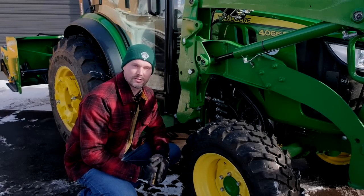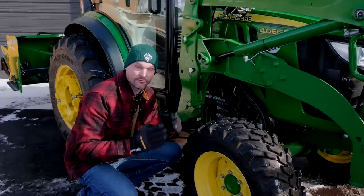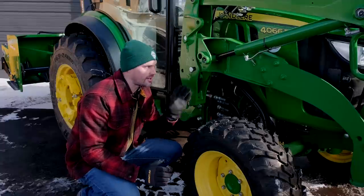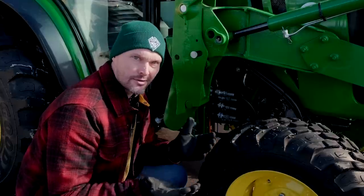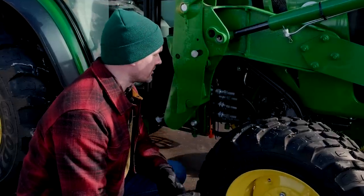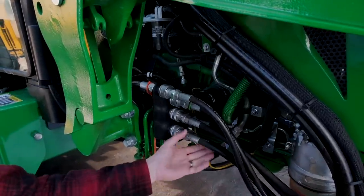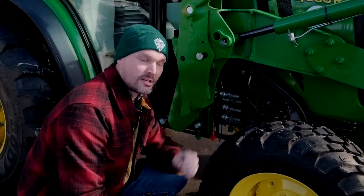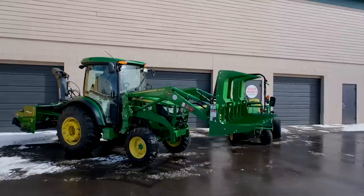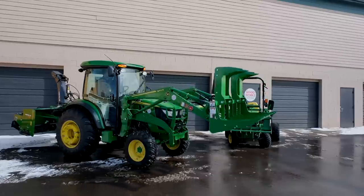Let's dissect this a little bit. We are talking about a function — not the third. It could be the first, the second, the fourth, the fifth. But a function in general on a hydraulic system could be called a circuit as well. Pretty much any modern era tractor that has a front end loader is going to have two hydraulic circuits. You'll have two hoses down here with corresponding outlets on your machine. That is going to be one hydraulic circuit — it allows the flow to go this way and raise your loader up, and then come back the other direction so you could lower it as well.